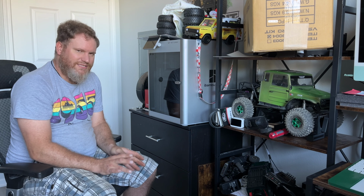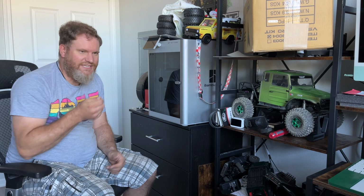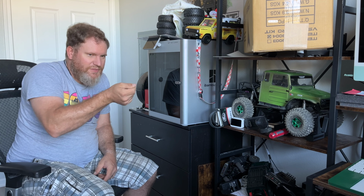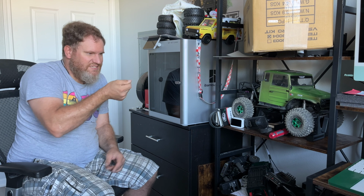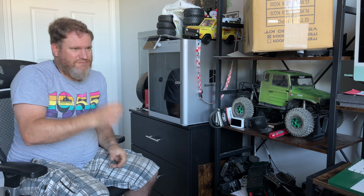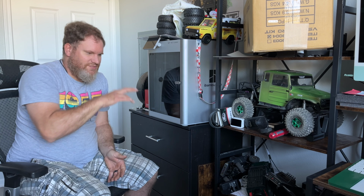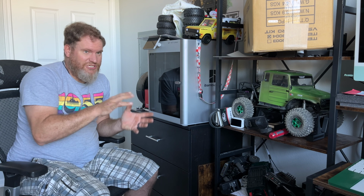Another thing that people struggle with starting out is bed leveling. And essentially with bed leveling, you're going to look like an idiot with a little piece of paper underneath the hot end and wiggling it while adjusting screws on the bottom of the bed. I honestly liked bed leveling because you could see the results when you get your bed dialed.